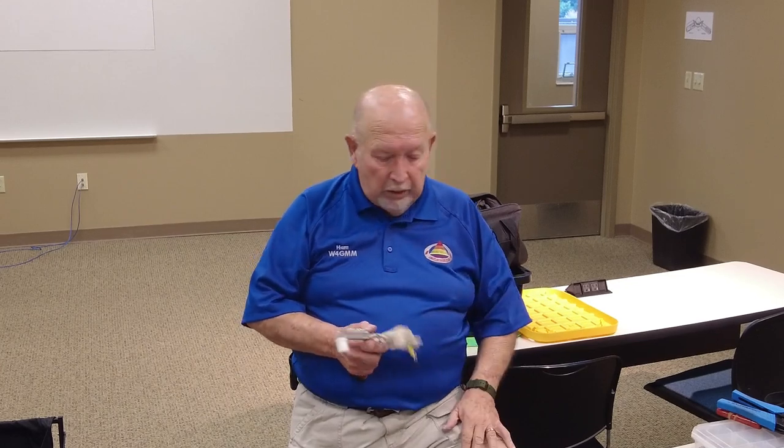That wasn't being struck by lightning, but all my house and those gutters and everything else were at such a high polarity, so negative compared to the other place, that they just flopped over. So it happens. So this is what protects, and it also protects you, because if something were to happen in the chassis, if the AC side of that radio got to the chassis, to the cover of that radio, and you reached in there to touch it, you'd get a surprise. By having it grounded, you don't have that. Hopefully, if it's a high enough potential that shorts, it will throw a breaker on your AC, and you'll have to find out what it is. So it's always good to have that.